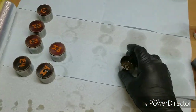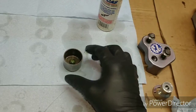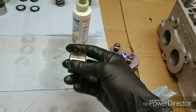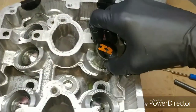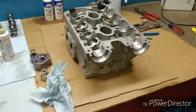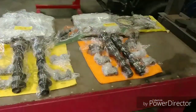It's pretty easy — just make sure that inside portion where the valve hits has got a nice gob of assembly oil. It's not rocket science — well, it is science actually, but it's easy science. I'm going to lubricate the next one well and drop it right into place. And that's in. Thanks for sticking with me. Wait for that next upload — I can't wait because then we get to start doing some assembly on a motor, and that's something I enjoy. Time for me to do these other heads. You guys have a great day.